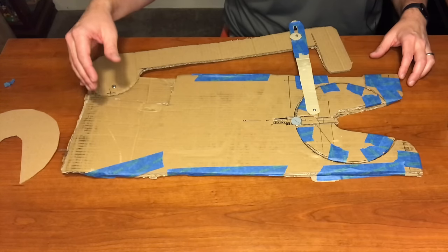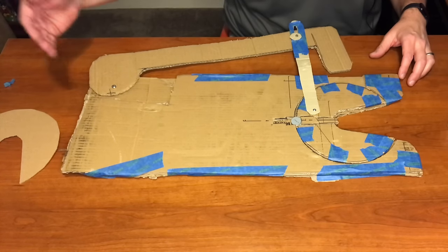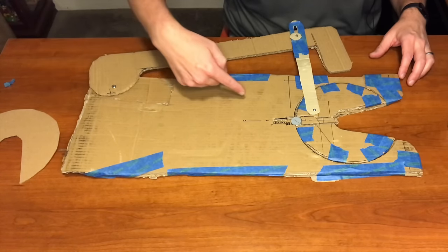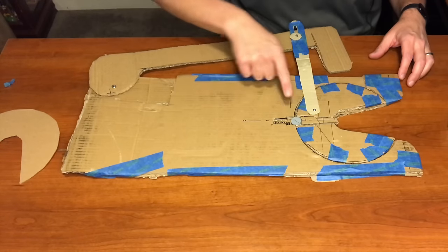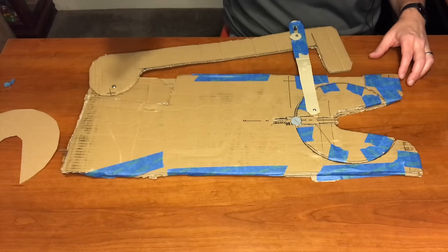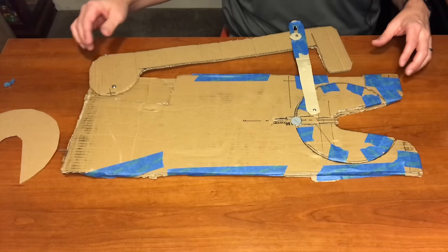And then there is a pulley car that also sits behind there. The pulley car is necessary because you don't want to pull the cable at a funky angle. You want it to be more of a straight pull. So you have to get the cable to go down and then up the lift hill. That's what the pulley car is necessary for, a sheave car right there.